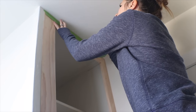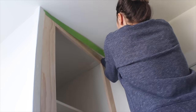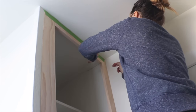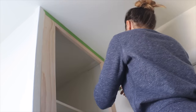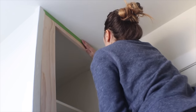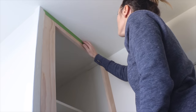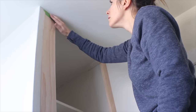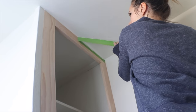For some more finishing touches on the top I put some frog tape down and painted the caulk I had added on this seam because the caulk dried clear and I wanted a really crisp paint line where the face frame met the ceiling. I put water on my fingers and sealed the edge of the tape with water — you can also do this with clear caulk, but there was already caulk in this seam so I just did this quick and it actually worked really well. Then I slapped some paint on there and look at that tape peel — so beautiful.